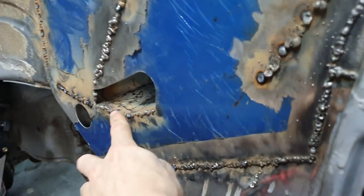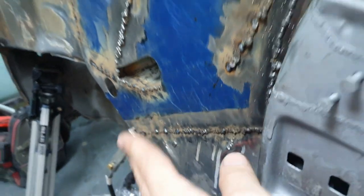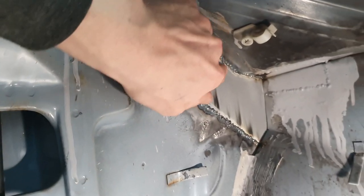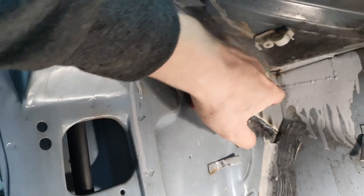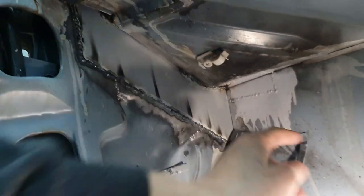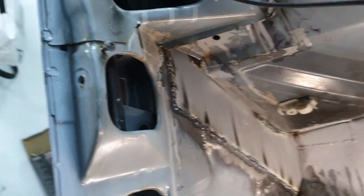All of this penetration is coming from this weld where it's a 90-degree type of butt weld, and you can see how nicely that's all fused together. So now I'm gonna use that technique of drilling the little holes and grinding a groove along this edge here and along this edge here, and then that's pretty much everything welded up. Let's smash this out.